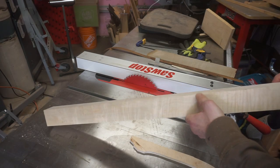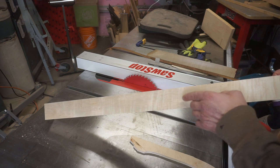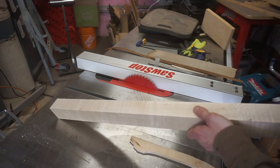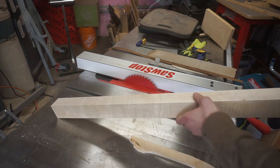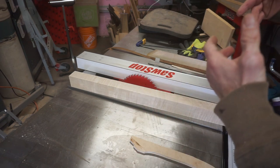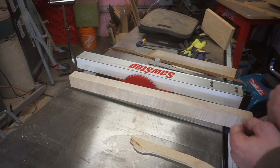This is a billet I'm going to use to make the tenon, which will go into the mortise in the table and the mortise in the breadboard end. I'm going to start by cutting a piece that is the thickness required to fit the mortise on the table. The cutter on the Domino is about 8 millimeters, so I'll cut this piece of wood just a little bit larger than 8 millimeters, then test it and keep trimming it down until it fits the mortise properly.